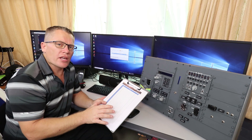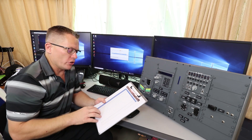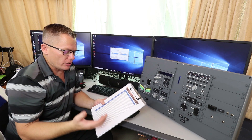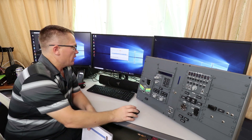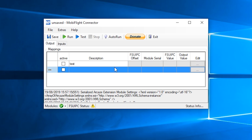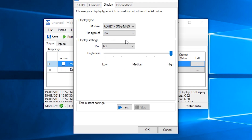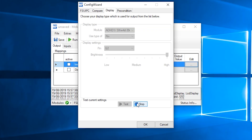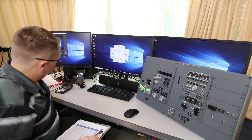In front of me I have a crib board — it's just a table with the Arduino board pins listed 2 to 53, and as I was going along creating the Arduinos, I noted which wires go to which device. So pins like 26, 28, 30, 32, 34, 36 are all LEDs, and the rest are switches. To identify which pin does what, we create a line called Test, hit Edit, go to the Display tab, select our board — aft overhead 1, given the letter Q — select Q pin 2, hit Test, and we can see that it's the Nav 1 indicator light. Then we stop, select Q4, hit Test — that's the ADF2 light. We write them down on the crib sheet and that's all the output pins identified.